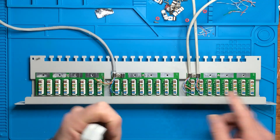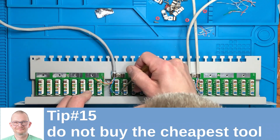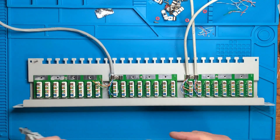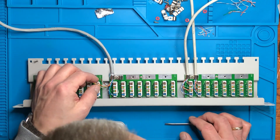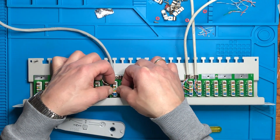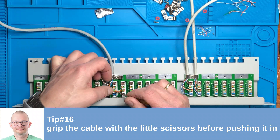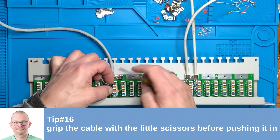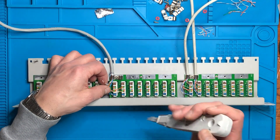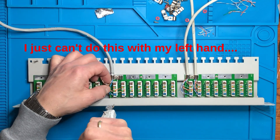I'm using a fairly inexpensive tool here to push the cables in, but do not buy the cheapest tool — a cheaper tool may give you additional headache. I'm not saying you should invest hundreds of dollars if you're only doing this once, but you should invest at least $20 or $30. When pushing the cables in, try to grip them with the little scissors on the tool first, then push it in — the tool will punch the cable in and also cut the excess piece of cable.